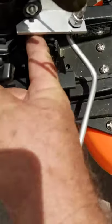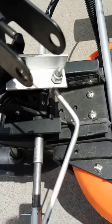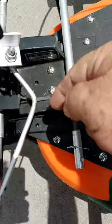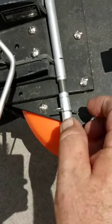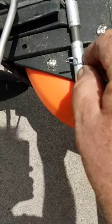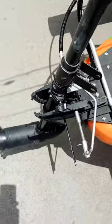Your locking release trigger up here — you need to cut about an inch and a half off it. When you're done with that, push your tube all the way through. Unclip the front piece, pull it out, pull it off, pass the tube all the way through to that line — the line will be just outside in here. Then push this back on, clip it back on, and put this through. Your assembly is going to look something like this. This one's about two years old, so it's pretty beat up, but that's how it should look with the motor pointed straight.